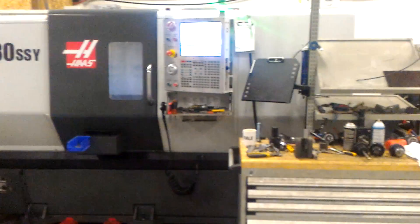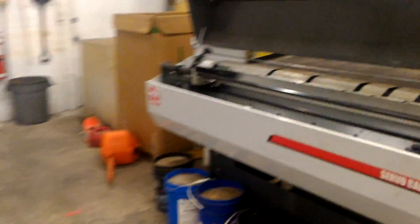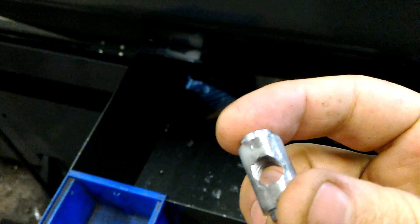Thanks again to Dale — check out this footage using a Y-axis live tool rigid tapping lathe. That's an awesome true production setup; with a bar feeder you can crank out thousands of these a day. We've got 11 positions in this soft jaw. Thread milling is a little more foreign to people, which is a shame, because it's a great way to cut threads. You can adjust the thread fit, cut different pitches, thread ID and OD.